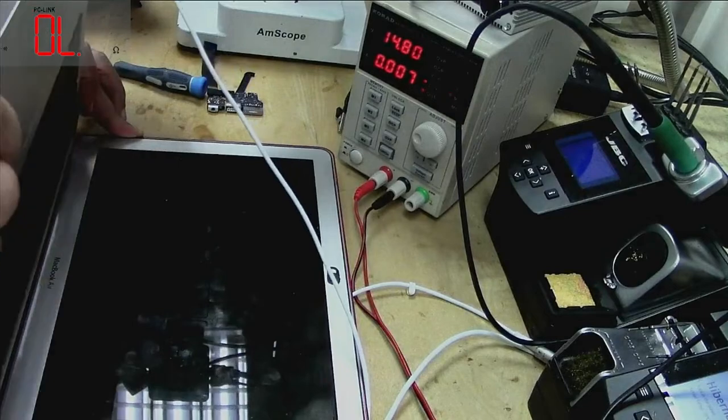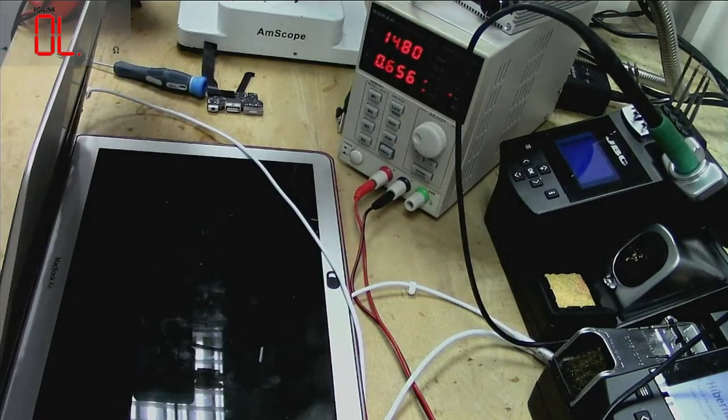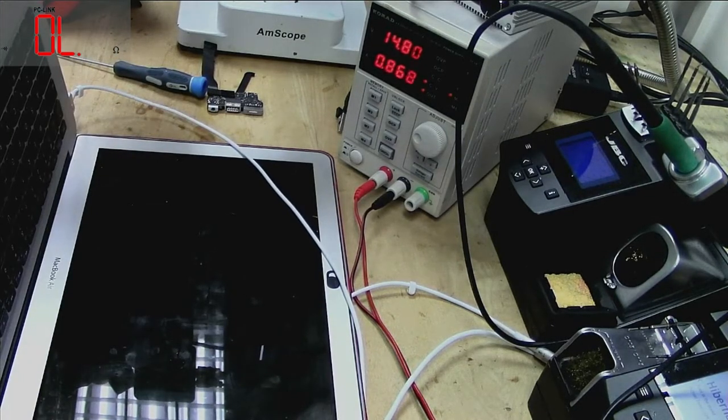And the next thing is, yeah, the fan is spinning. I can see on the power supply it is turning on. Yeah, did you hear the chime? Yeah, turns on. Yep. So that was a short on the PP bus underscore S5 line, and the shorted cap was C7314. That's all been replaced and the MacBook turned on fine.